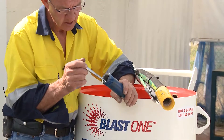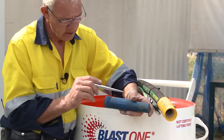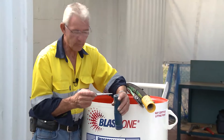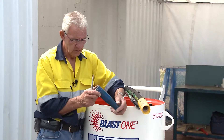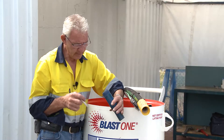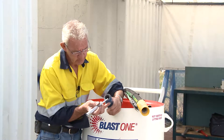What's the outcome of that? It wears prematurely, and also it doesn't allow the garnet and the abrasive to exhaust in the appropriate manner on the exhaust side of this nozzle. So you have to look after them, keep them clean, and make sure that they are not damaged.